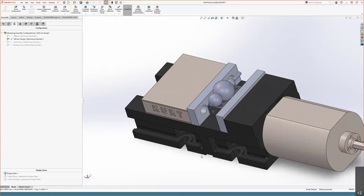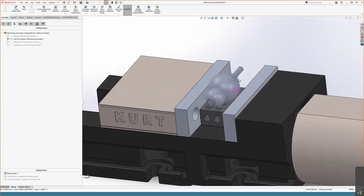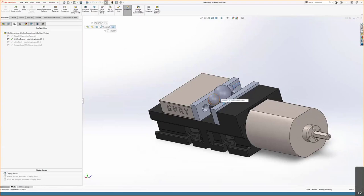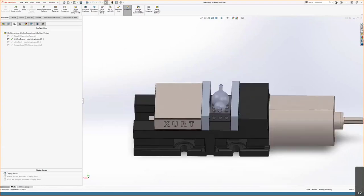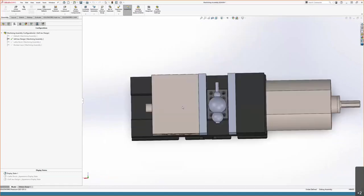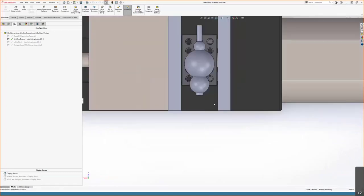That's not going to work here because we just don't really have enough meat to support this work properly on either of these cylindrical faces. So we have to work with the spherical faces. And we can use the lessons that we would learn from V blocks to support this.